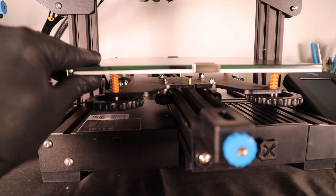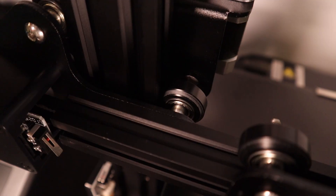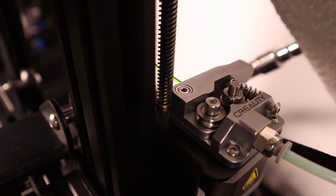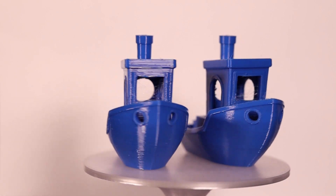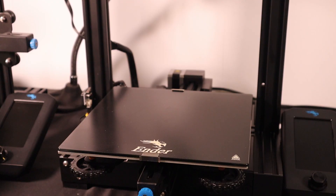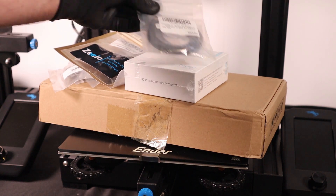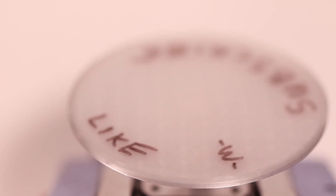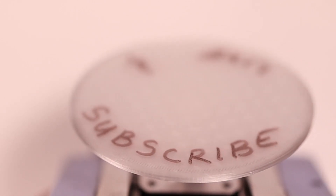I'm a little surprised that this printer has held up this well after more than 3,500 hours of printing. The wheels are showing signs of wear, the belts could do to be replaced, and the Z-axis nut is likely a little worn as well. We need to get these printers making nearly identical prints so we can kick it up a notch from there. Banggood has sent me some upgrades to test out, which will be the subject of future videos. Hopefully you found this video helpful — if you did, a thumbs up is appreciated, and don't forget to subscribe so you don't miss the next batch of videos.